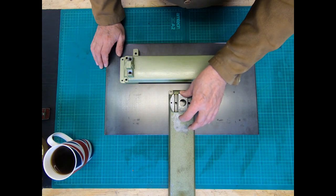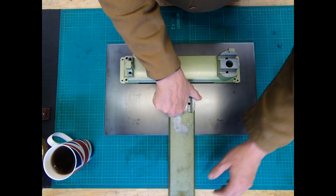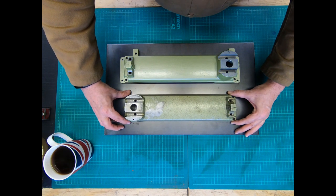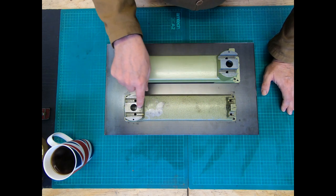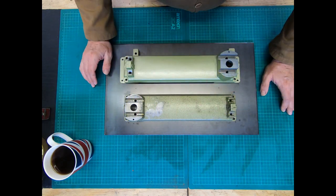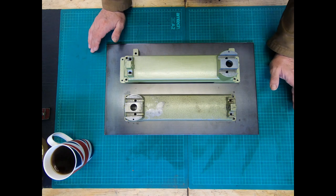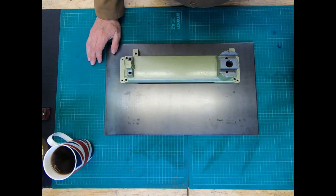This is a phase-one idea. There's a chap whose stuff I've been marvelling at on eBay, but it's extremely expensive. With all these machines I could make it myself, but what he's done is effectively created something very similar — he's got two what we've been calling the ways, and then a part that's movable along them, so he can move his whole milling head back and forward. I'm not sure how sturdy that is, but it looks quite good. I'll investigate further, but that's for the future — my main goal is just to get this lathe running so we can use it for the clock-making project.